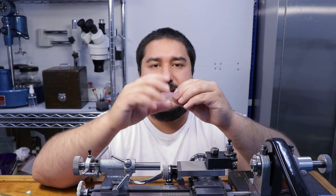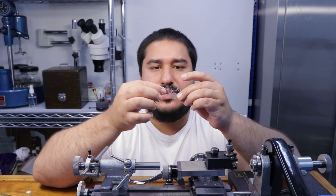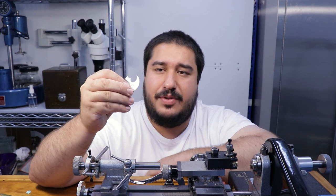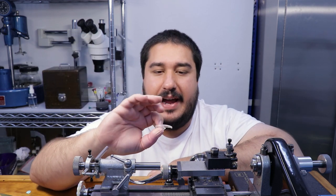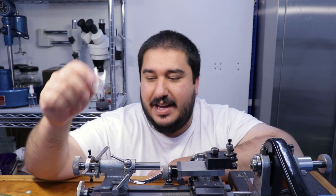Now the thing is that the actual thickness of the material is around 2.25mm, and I only have 2mm acrylic, so some of the depths are really out. Under the barrel bridge was only like 0.1mm, and as I pulled it off the double-sided tape, I was a bit too keen and excited, and it just snapped.